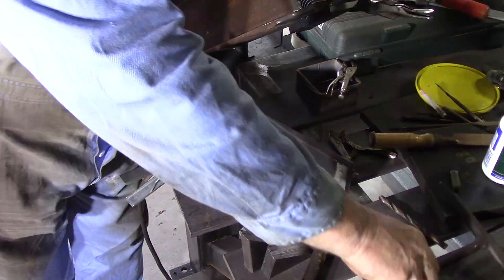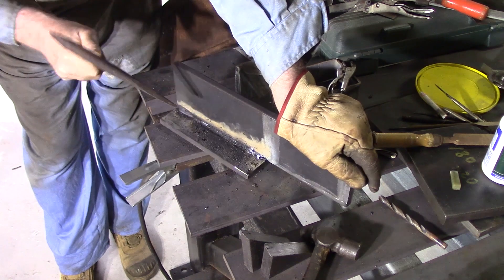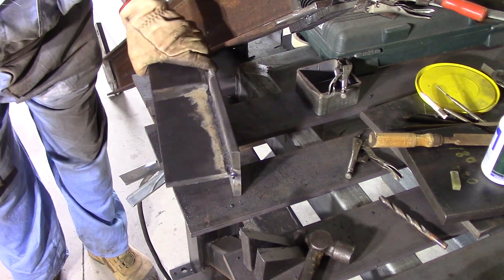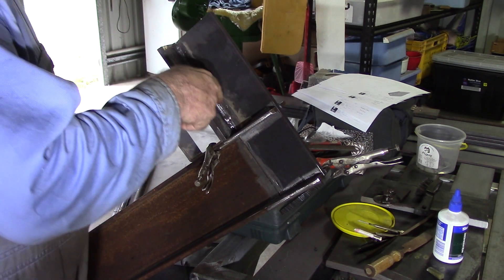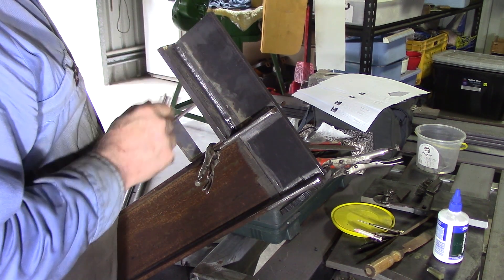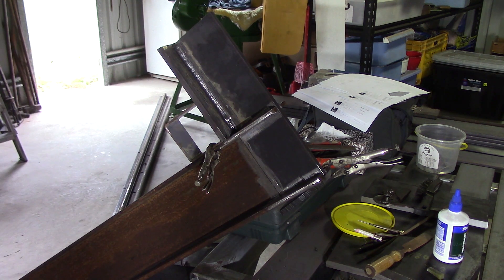The shear could benefit from a little bit more bulk. I had a nice bead down in there but I think it could use a bit more. I decided I'd leave it with just a single bead there — it's a really nice, neat bead with good penetration. Given the loading on it, I'm going to cross my fingers and hope that'll do the job. Reasonably confident it will.